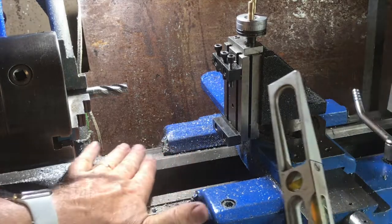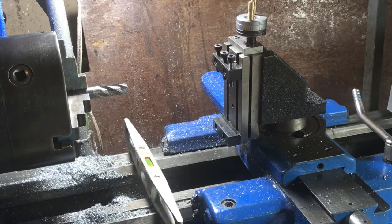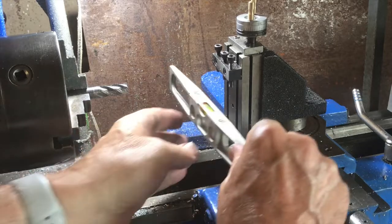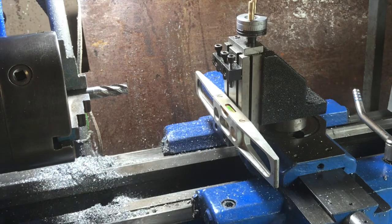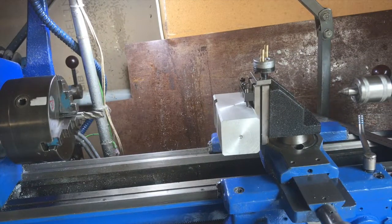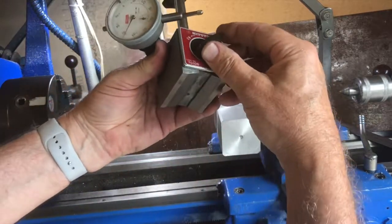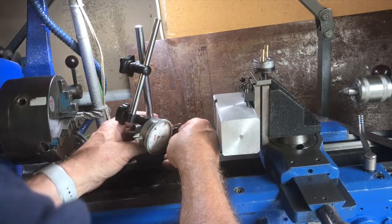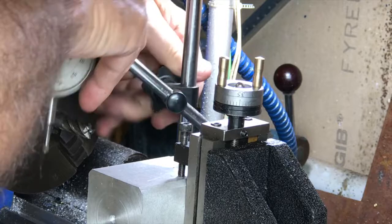Here's a quick and dirty way of checking that the jaws are horizontal: just put a level on the lathe. The lathe isn't quite level, but I notice exactly where the bubble is and then adjust the piece so the bubble is in exactly the same position, so I know it's level. When I put the work in I can check that it has the same level position. Next, I've got a dial gauge on a magnetic mount — you turn it and the magnet inside locks it down onto the lathe bed.